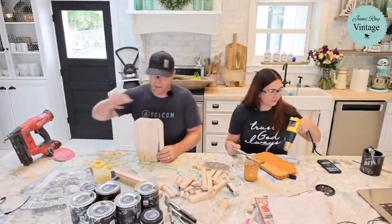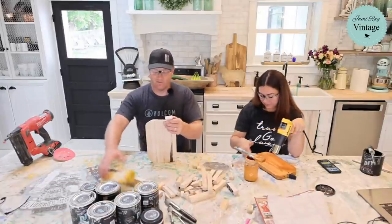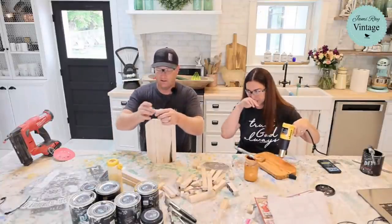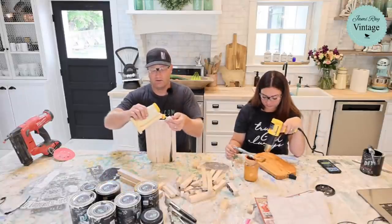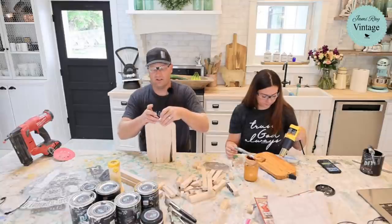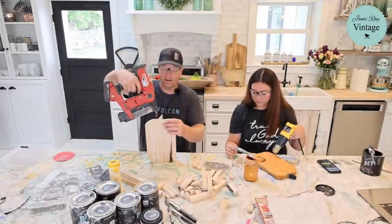This piece came from the other board and that's going to be our stem. For this I'm not going to nail it — I'm using a liberal amount of Titebond wood glue on both sides. This sets in about 10 to 15 minutes and cures strong and structural in about 24 hours. I'll let that sit for a minute before touching it.